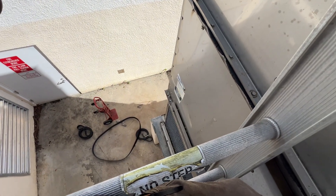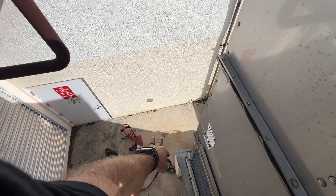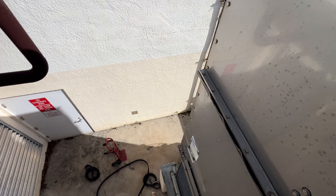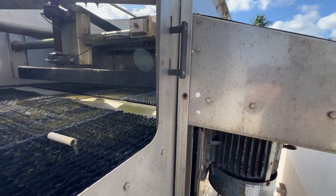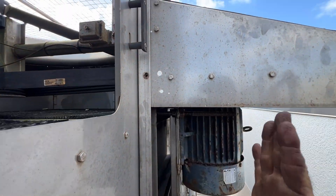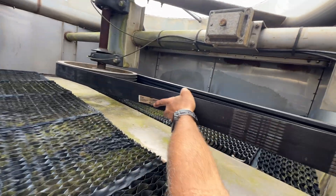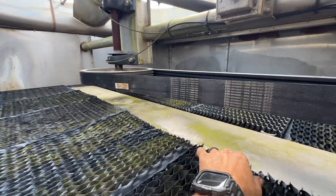So those other belts are the wrong size. We don't know why they're on site here — probably left over from a prior order. The ones that came off are B-4-154, or 4B-154. The other ones were 158, which would be too big for this side — maybe they're for that side, but it's probably the same. Alright, I think I got it tight enough. Make sure it's level and that the motor isn't tilted one way or another. Looks like it's pretty good.